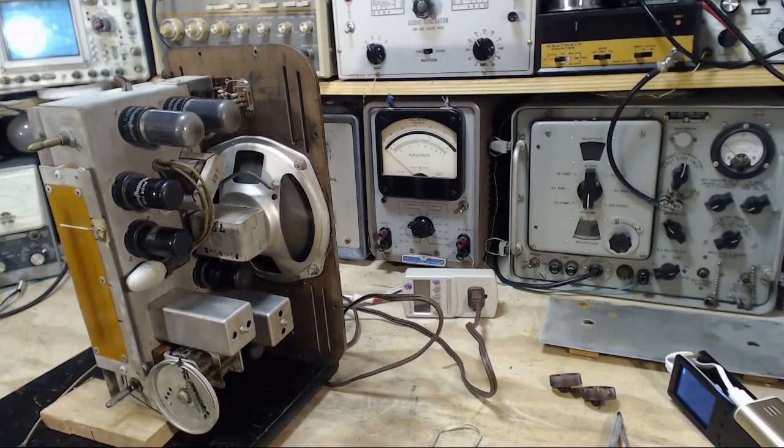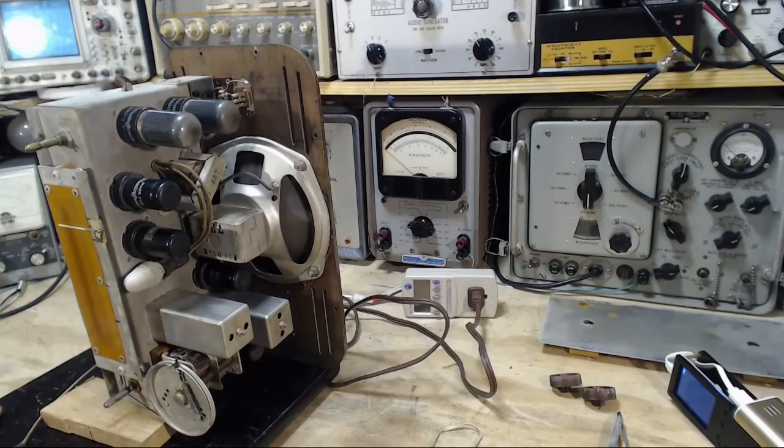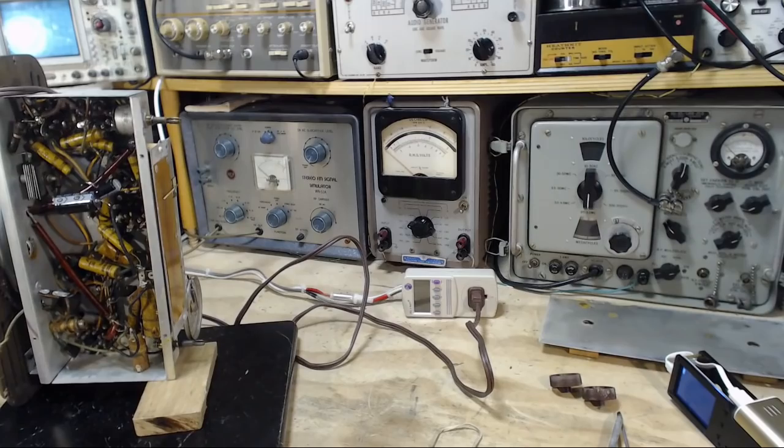Say, didn't I learn that lesson a couple of amplifiers ago? I hunted for a hum for a while and then eventually tracked it down to one of four output tubes. So we can even start right there. If we can eliminate that buzzy hum, I think the radio is done. I think I would leave it just as it is. I would still give some consideration to putting a silicon diode in here. Get rid of this guy. He might cause the hum too, I think.